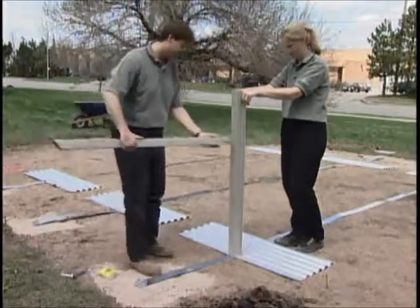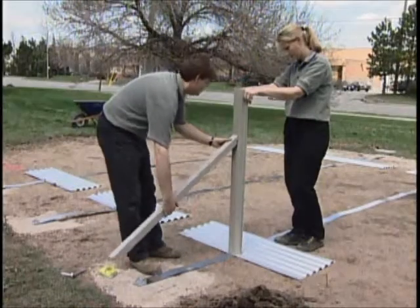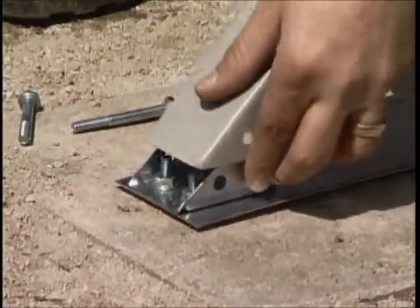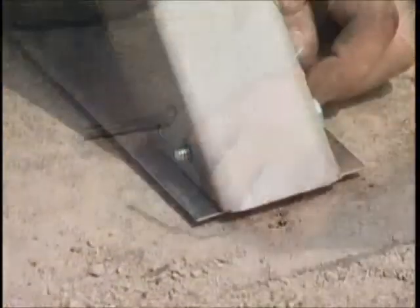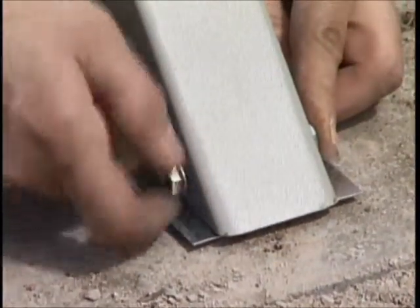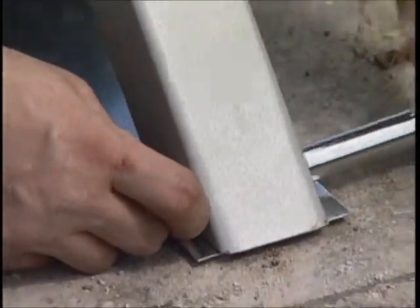Holding a diagonal brace approximately horizontal with the open side down, insert the 4 tabs of the diagonal into the upright. Pull upward on the tabs, and maintaining this upward pressure to keep the tabs in place, swing the other end of the diagonal down over the diagonal bracket. Insert two 2¼ inch bolts through the holes in the diagonal and diagonal bracket and fasten with 2 nuts. Do not over-tighten these nuts. They only need to be snug enough to ensure a secure fit.